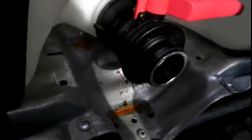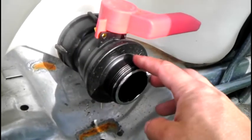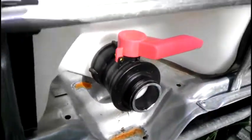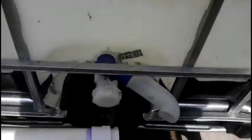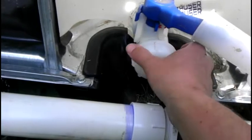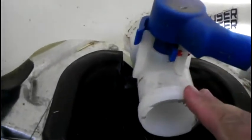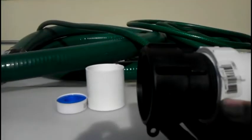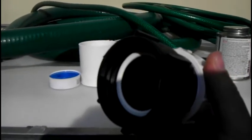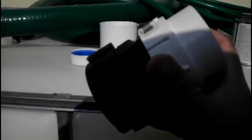The reason this one isn't hooked up is because most of these have NPT threads — national pipe threads — and that's what national pipe thread looks like, these threads right here. This will fit directly onto PVC, but this one does not. This one has a different type of thread they call buttress — you can tell it's very coarse — so I had to order a buttress-to-NPT thread adapter.